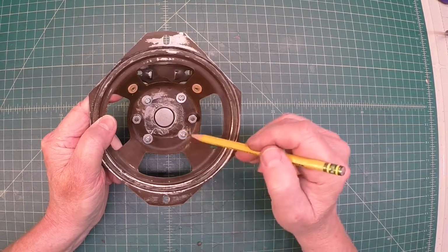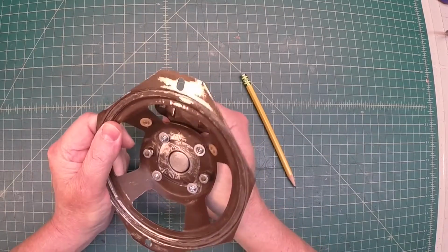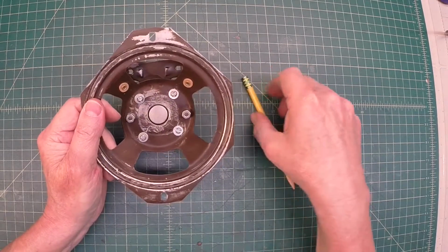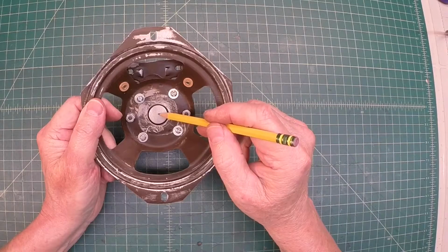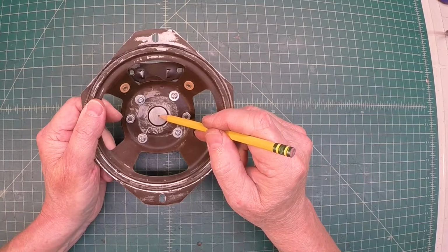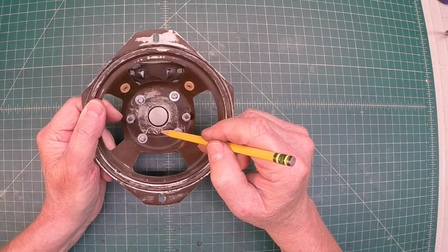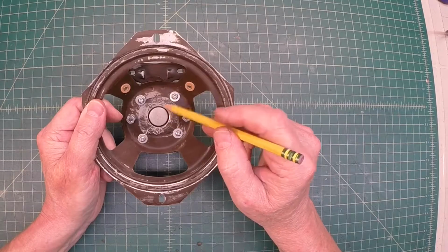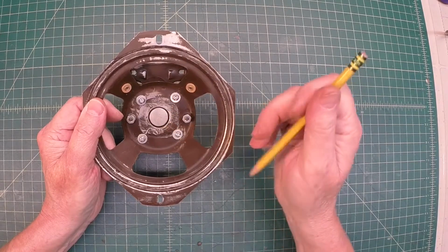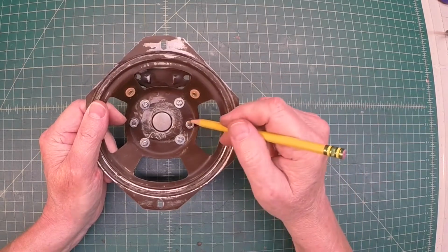So like I've done in the past, I've drilled the holes here in the frame just a little bit bigger. They're tight right now, but they're loose enough where I can move this around just a bit and make some adjustments. But in some additional videos I'll show you guys how I'm going to at least do my best to get this completely centered inside the field magnet assembly piece, as well as making sure that piece is centered into the speaker frame itself. If not, we'll have rubbing of the voice coil. So all this effort would be for nothing unless we take the time to do it right.